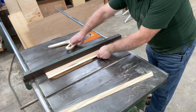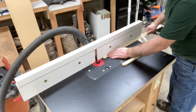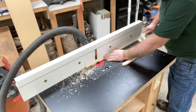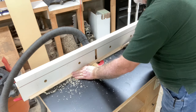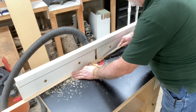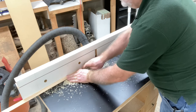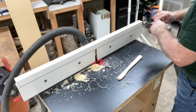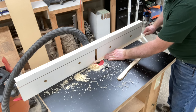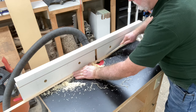Once I've completed all of this and have all the strips that I need, it'll be time to head over to the router table to put the final profile onto these strips of wood. And you'll also notice I'm not using a tape measure — I don't have to be 100% accurate to make these triangle shaped pieces. At the router table I'm using a half inch straight bit to put this profile on here. Now this is a small piece of wood that you're cutting, so if you feel uncomfortable using a router table in this manner, please skip this step and just use the triangle pieces. But for my case I'm using a push stick and I feel very comfortable operating the router in this manner, though I know this is not for everybody because these pieces are very small and you're working reasonably close to the bit.